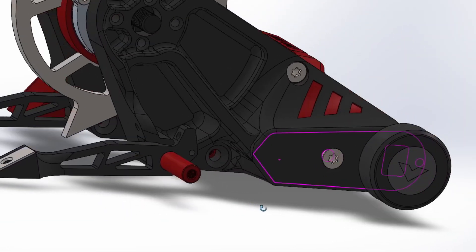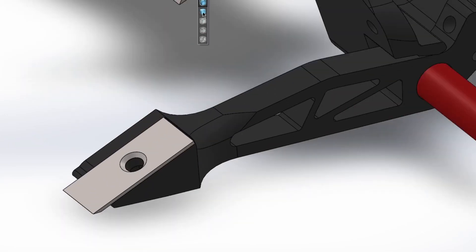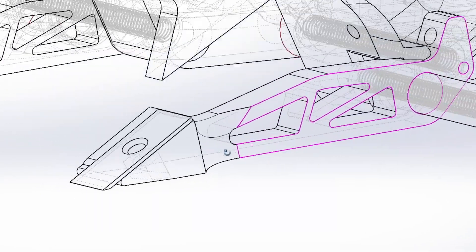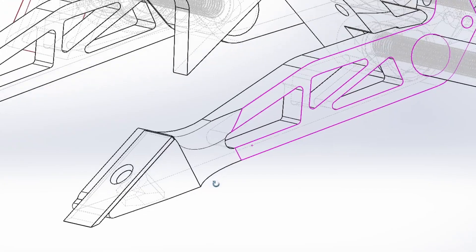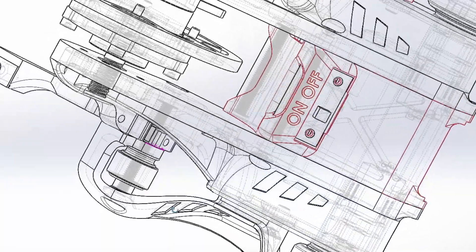For the fork tips, I used a piece of titanium ground level with the floor to help get under robots. This is retained by an M2 screw and a little retaining lip alongside the piece of titanium to stop it from rotating. To keep weight down, I plan to print the forks in polypropylene, same as the chassis for this robot.